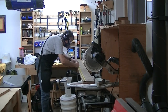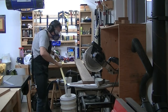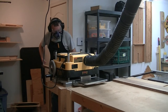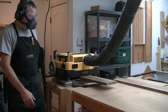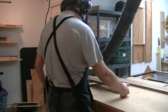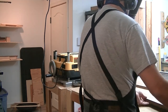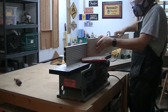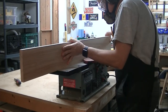For this project, my friend asked me to build a base with walnut boards on the outside and a maple board in the middle. So the first step is to cut the boards to their rough length. Since these boards were not all the same thickness, the next step is to use the planer to even things out, and then use the jointer to make sure that all the faces that would mate with each other would be perfectly square.